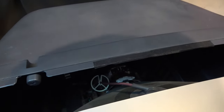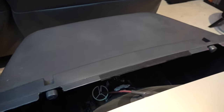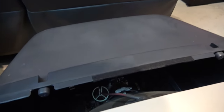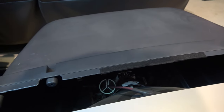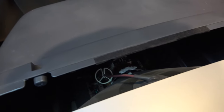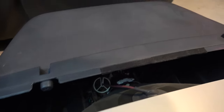There's no metal frame inside the monitor, so I'm going to bring my other monitor out with its big metal cage, use that as our earthing cage, and then take this anode cap off with the special screwdriver to discharge it. Let's do that now.